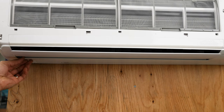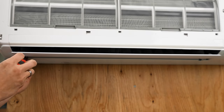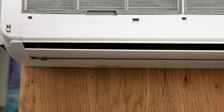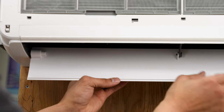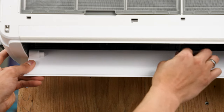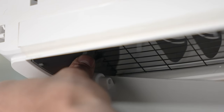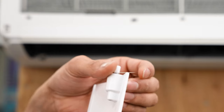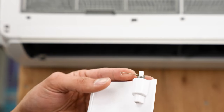Next, we're going to remove these two little clips. While I'm still on the bottom side of this unit, I'm going to take out this louver blade. I'm going to pop this pin in the middle just with your thumb, push that out, pull it towards us, loosen that there, loosen that. Now on the left-hand side, there is a spring. This spring wants to unwind, and that's fine. Just keep in mind that it needs to be tensioned back into place when we put it back.